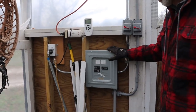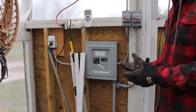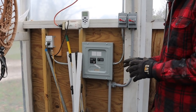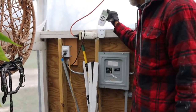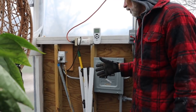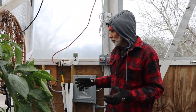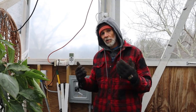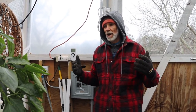I installed an electrical panel over here that's fed by a main box up at the house, so we can have electricity in here should we need it. I installed an outlet which our fan is hooked into — this is the thermostat right here that controls that fan up at the top. Everything is thermostatically controlled, and what that does is turn this high tunnel into a greenhouse because we can close it all up and thermostatically control it.